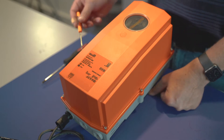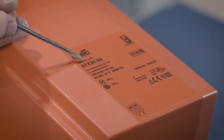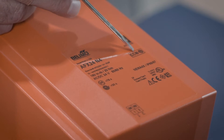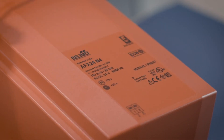If you know that you want the damper shaft to rotate fully clockwise upon loss of power, please specify fail closed when ordering. If you look on the face of the case here, you'll see this is an AFX24N4, which means NEMA 4, and it comes from the factory set for counterclockwise. So that means on a loss of power, this actuator is going to rotate in a counterclockwise position.